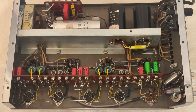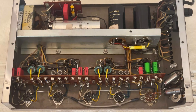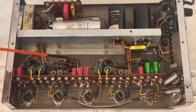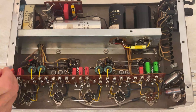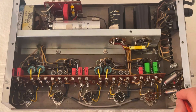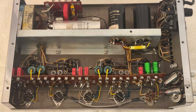The first thing that I do when I work on an amplifier is a visual inspection, and I was impressed and shocked by the pristine condition of this amplifier. The tube sockets show no sign of heat at all. The cloth on the wires of the transformers look absolutely brand new. I have never seen one in this condition. These pots look absolutely brand new. These imperfections are from the manufacturing and are perfectly normal.